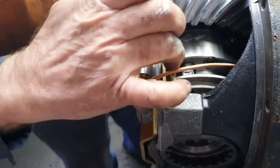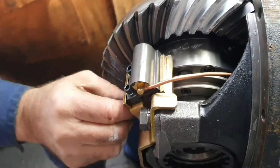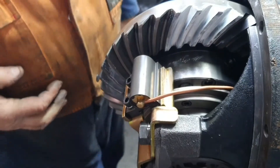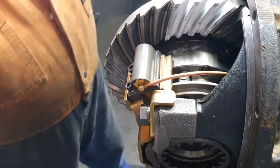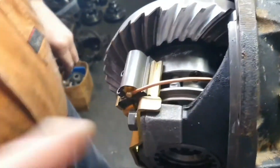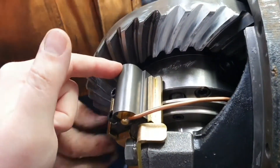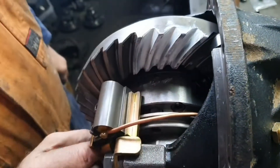This defeats the purpose of having to slap at each end of the stroke. I've rung them up numerous times — they won't listen, they won't make any notes of it or anything, they don't want to rectify anything. So when you lock the diff, it strokes over too much without that washer. There's no clearance when it's locked — all jamming up. No clearance at the other end either. The fork in there jams up, so you need that clearance. The fork's all jammed against there.